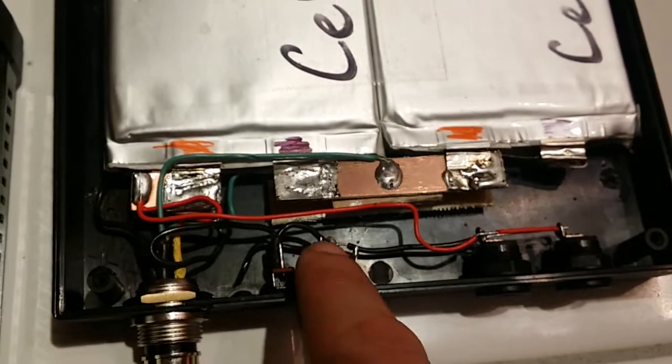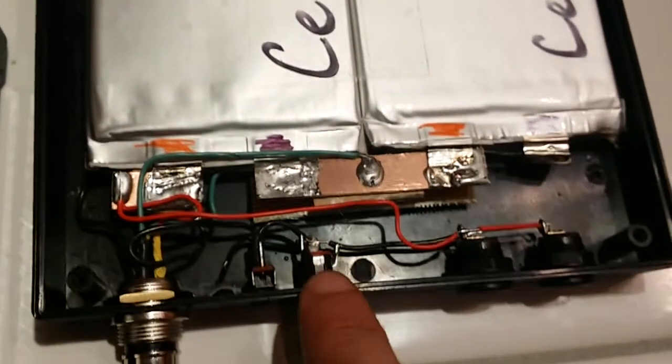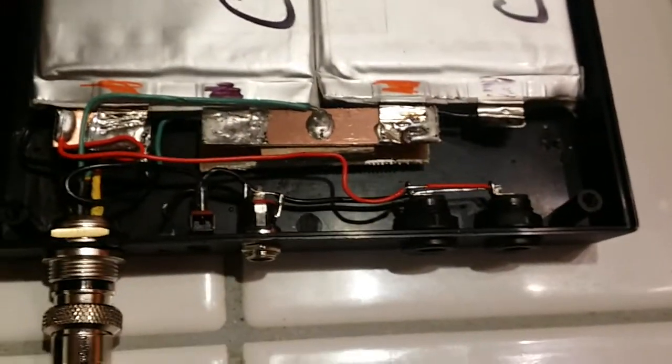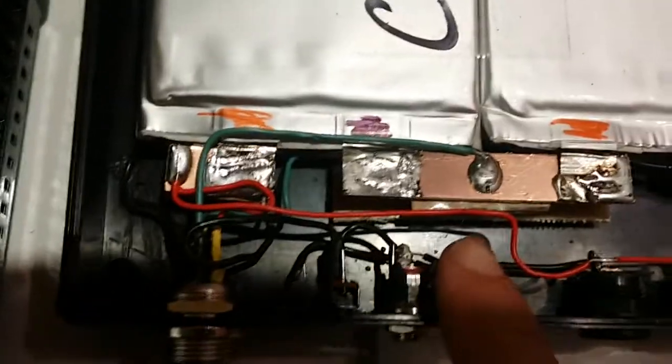When the barrel is out and not plugged in, both connectors have continuity, but when you plug it in the outside connector is no longer connected. I have no idea why anyone would want that unless you're running some sort of relay — when you plug it in you can choose to have a hot switch. I tried to make my wiring as clean as possible. I had to pull off one of the studs by accident; it originally came with six but now there are four studs, and the missing one is held in with double-sided tape and it's not moving.